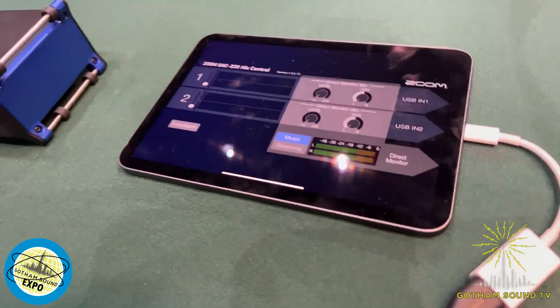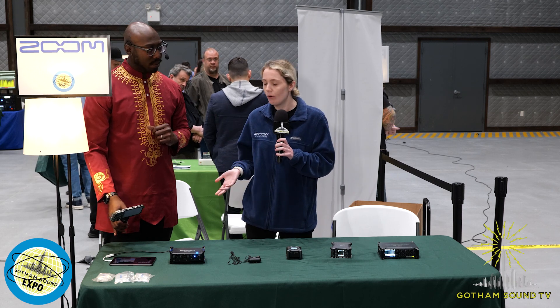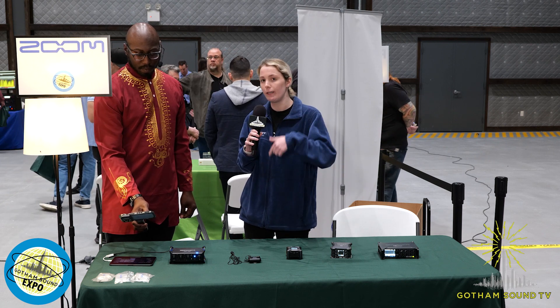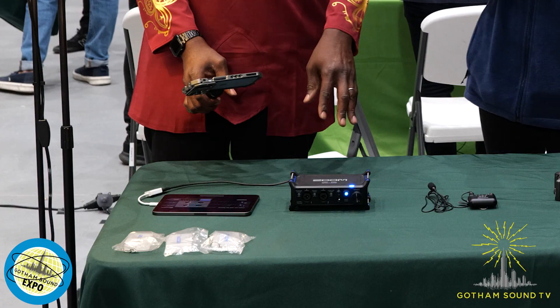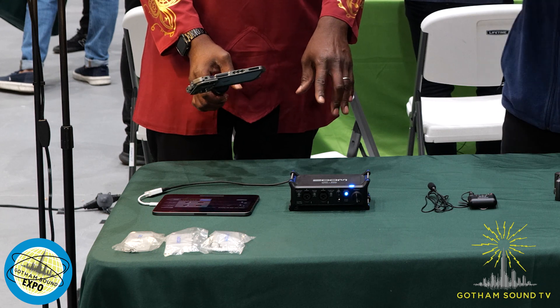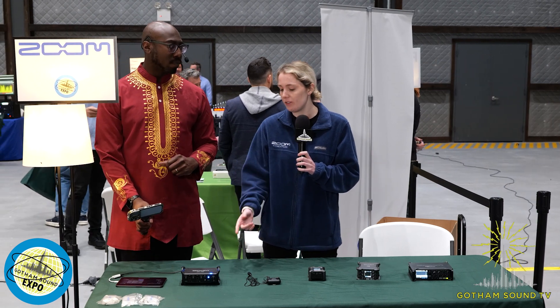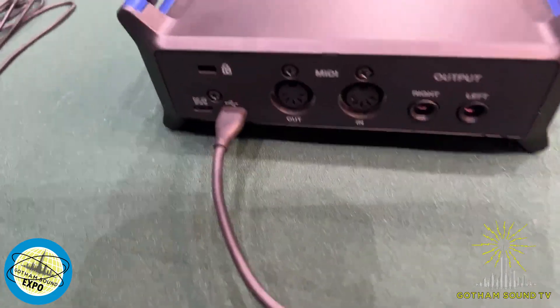Music mode is more of a multi-track mode — we'd recommend it when recording in a DAW, whether recording a song or doing a podcast. Streaming mode we'd recommend for live streaming software such as OBS, Zoom conferencing, or anything like that, because it routes everything through the two inputs including loopback. This device is USB bus powered. If you wanted to use it with an iPhone, it cannot run off lightning power with a dongle — you'd need to plug it into an additional USB power source via the second port. Regarding Bluetooth compatibility with Tentacle or Deity, the only confirmed device is the UltraSync Blue.